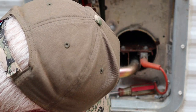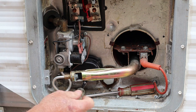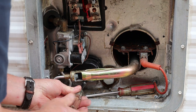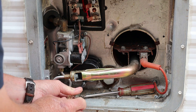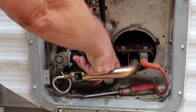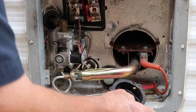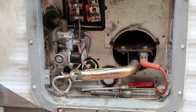So the next place we have to go is the heating element — getting that cover off can be a whole other situation, because it's behind the burner tube and gas valve and all that. It should have three screws in it, but I think there's only two. There it is — I dropped one. It didn't need three anyway. There's our heating element.